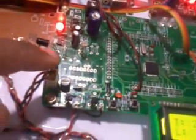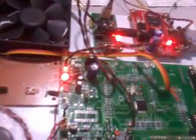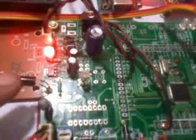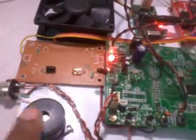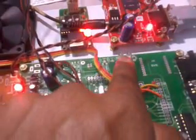One is the temperature sensor, whose output is the engine cooling fan. We are also using one MQ2 smoke sensor, a gas sensor. It was connected to P0.30 and this to P0.28 ADC. This is the fire sensor, and this is the LDR sensor. The fire output is the buzzer, the smoke output is the buzzer, and for the LDR output I used two LEDs.